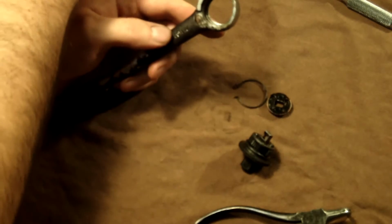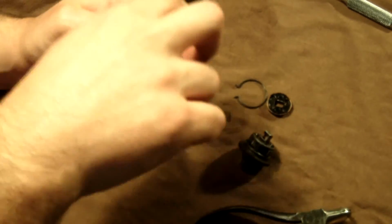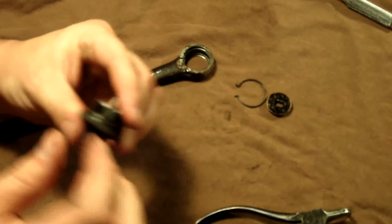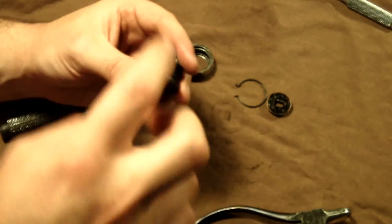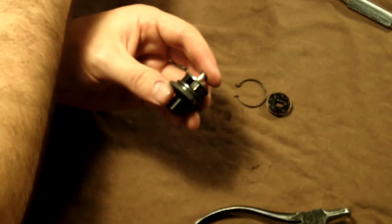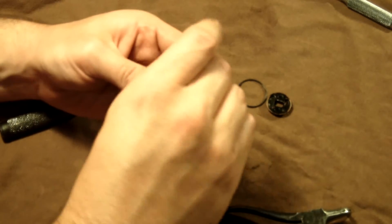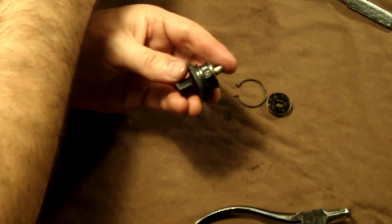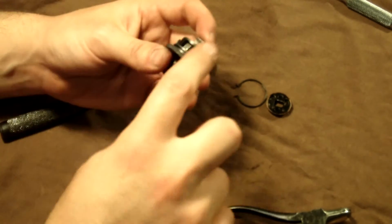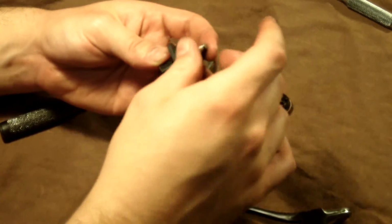And then go ahead and get grease on these gears, just a little bit. Any excess, you just wipe right off, and make sure those gears are done real well. I'm going to check these pawls. I don't think I did them. If I did, I'm not going to put a lot on there. Okay, there's one. There's two. There's three. And there's four. A bit much on that one.